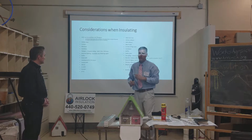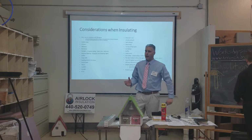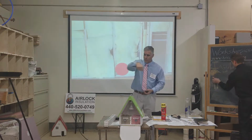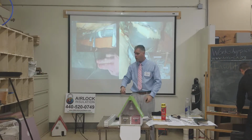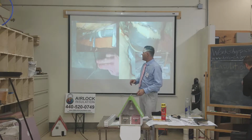And now when you get up in the heating duct, some houses have old heat duct systems where they didn't seal them up properly. So you can get a canister of duct sealant and get a paintbrush and go around and paint the stuff over all of your seams. Anywhere that the metal comes together, where it goes down onto the drywall, just get up there and spend an hour or two just painting that stuff up there. It will be such a blessing to you to do that.